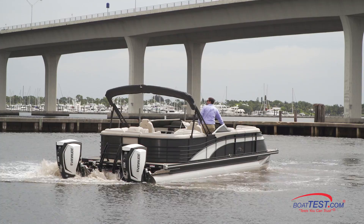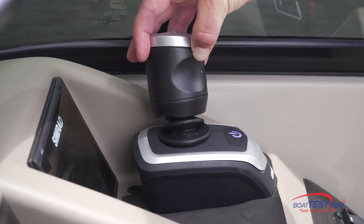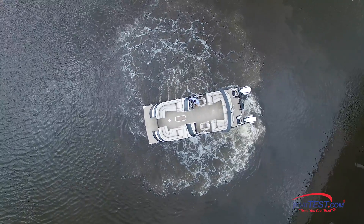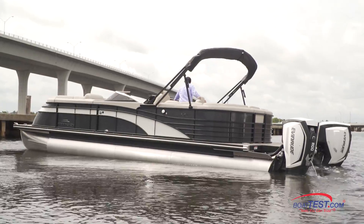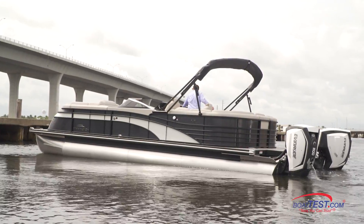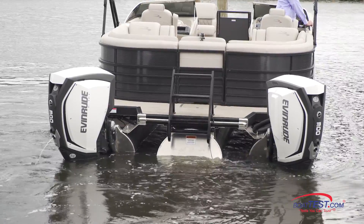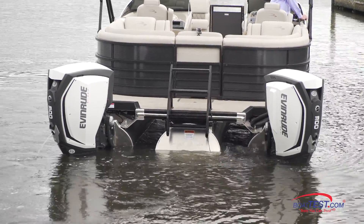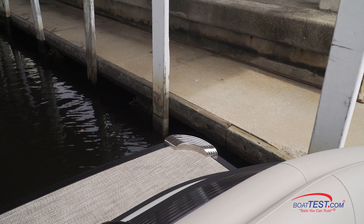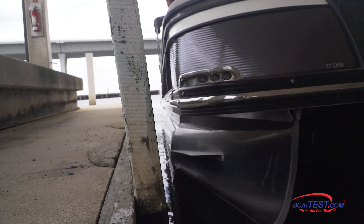When you want to spin the boat in its own length, just rotate the joystick and she spins in the desired direction. An increase in the twisting moment results in an increase in RPMs and a quicker spin. Pontoon boats are particularly lightweight and have no keel, so when the wind is blowing, the fencing acts like a sail to push the boat off course. With the i-Doc system, the gyroscope counteracts this, so the ability to sidestep the boat with ease is a major advantage. We finish the test by putting the boat back in its slip, and it's impressive how accurate the system is with this large and ungainly boat.